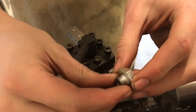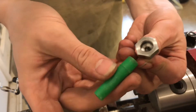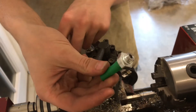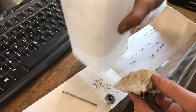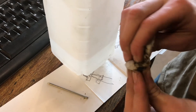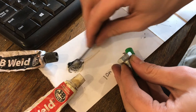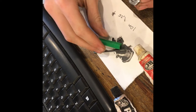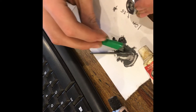Here's our finished product and this is what we started with, and here is the nozzle that fits inside. The lathe worked really well for this part. Before we put the green cap on with JB Weld we're going to clean the surface with rubbing alcohol to make sure it'll stick. So we'll put some JB Weld on to connect the green part to our bolt and let it dry for about 16 hours. Now we're going to add the JB Weld and put it into the bolt.